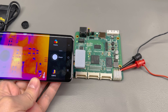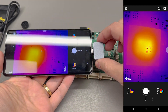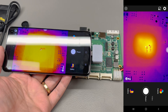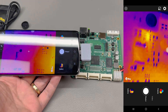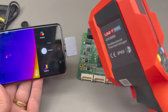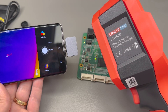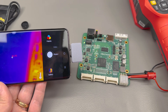The macro lens is the most interesting feature for people like myself who do PCB inspection. With it, I can get really close to an IC package — attaching this lens gives you about 25 to 30 millimeters working distance. At that resolution, this is close enough to see where different areas of a die run at different temperatures, or to see actual hot spots on the silicon die, or even different dies inside the same package. This clearly can't be done with a handheld unit like the Unity, which is a great camera but just can't focus that close. There are some DIY options and an original Unity upgraded macro lens, but it wasn't available when I originally got the Unity.